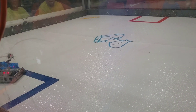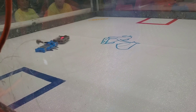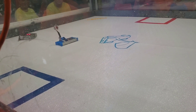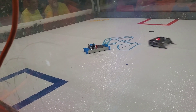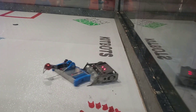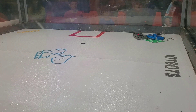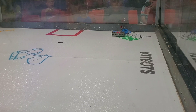I know he's going to be a lot faster than me, but right off the bat those wedgelets were working great as long as I could stay squared up to him — which I did not right there. I'm able to self-right and keep going. Unfortunately, my spinner comes off because the shaft on the motor just completely sheared away. I found out that the shaft is actually hollow aluminum, which is not ideal, but I was still surprised because I went the entirety of the last event with no issues and the same weapon setup. I'm definitely going to have to work on that for future events.